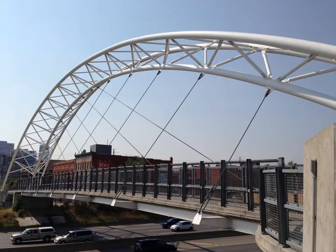This shows the connection at the road bed. This beam is coming out and tapering towards the end to express the fact that the loads create a moment which is more severe near mid-span. That beam runs all the way through the bridge and is supported on the other side. These beams have to be tubular because in certain instances they're being supported by cables which are pulling to the side, introducing lateral bending stresses, vertical bending stresses, and torsion — making them tubular is the appropriate response.